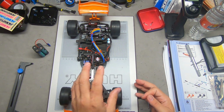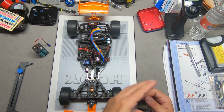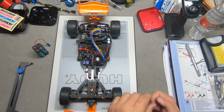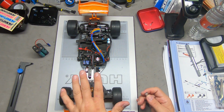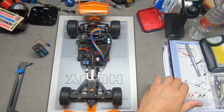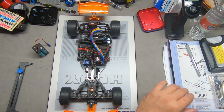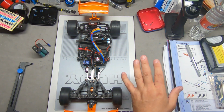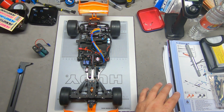The thing with Lexan is scratches, scrapes, when you paint them, they go clear again. So if you did scrape up the windows a little bit, tint would probably hide that, but still better not to mess with that. Just avoid the windows, and don't put your window masks on at this point. Make sure you've done all of this stuff ahead of time before doing your window masks.